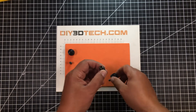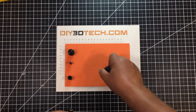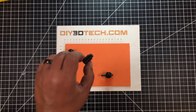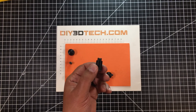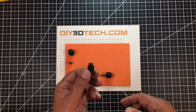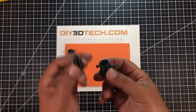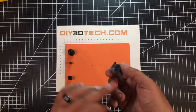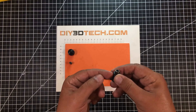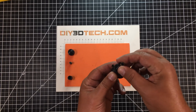Your lens will thread into the lens holder. This has to be pretty high tolerance because there's a very small hole at the end, and it has to be very square. While you can press-fit the lens in, it really should be tapped — the tap is about $14 on Amazon, I'll have a link below. The lens has to sit basically perfectly square in the holder so the beam doesn't intersect the side and goes through that tiny hole at the bottom. Once you tap it and insert the lens, this goes in your laser and you focus it.